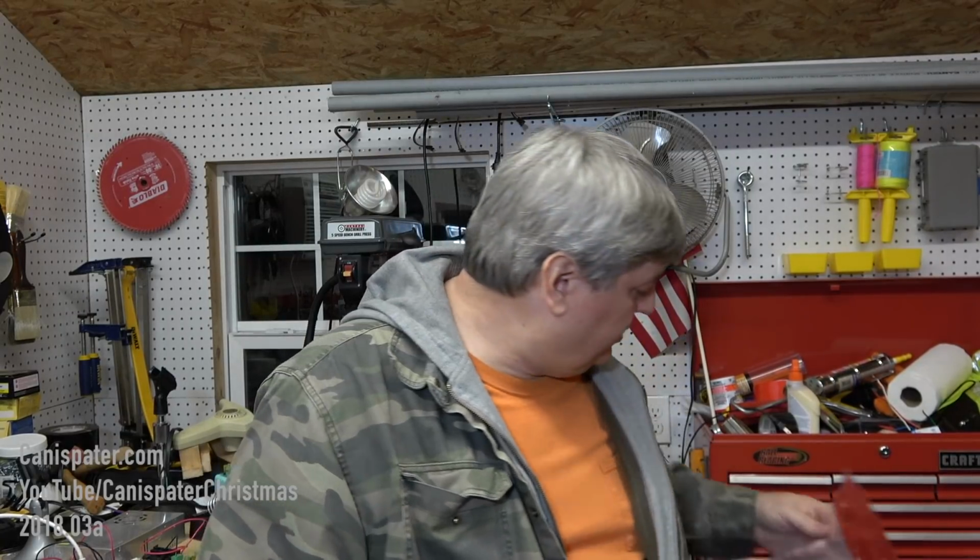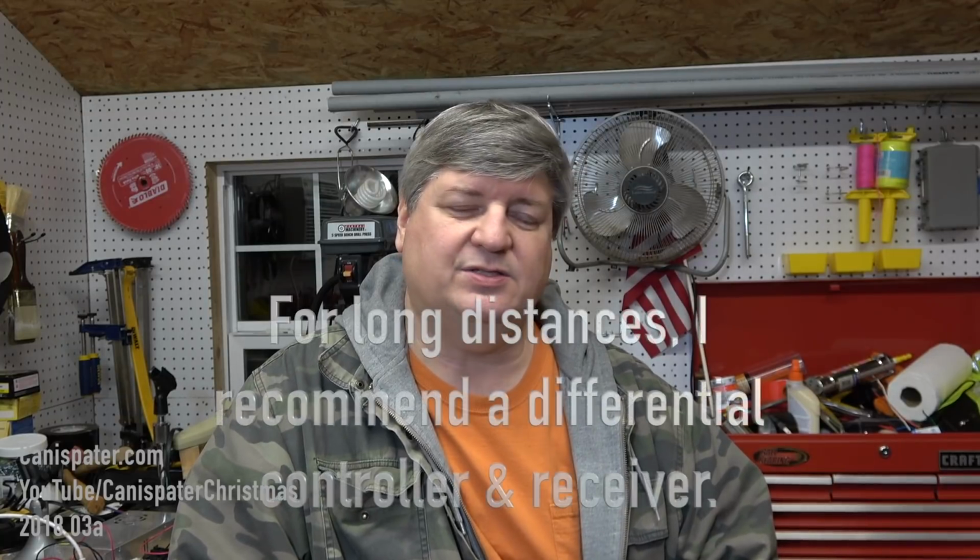Others were giving me cautions about, well, what gauge cable is it? It's standard stranded 24 gauge cable. So 24 gauge cable does not have a whole lot of copper in it, so it doesn't have great current handling capability. Ethernet cable is designed to carry data, so it does carry the data signal very well. You can hook pixels up to it. You can use it to run pixels certain distances, but really you need to do your own measurements and determine whether or not it's going to be something that you want to use in your display.